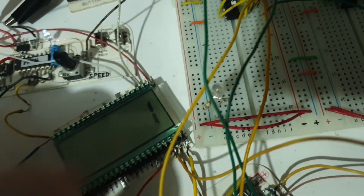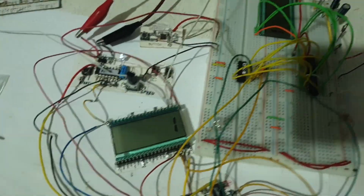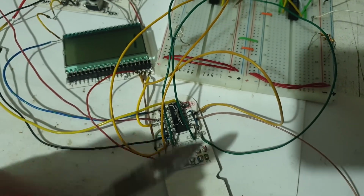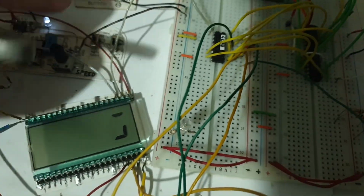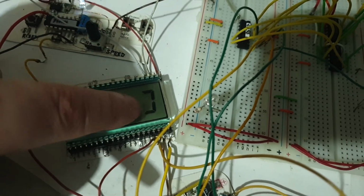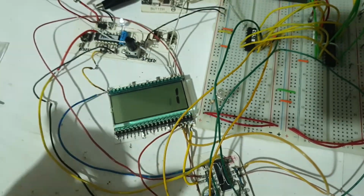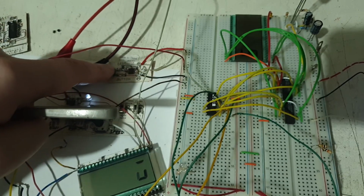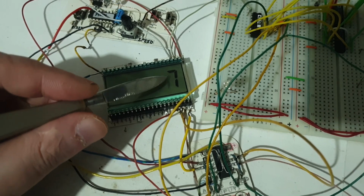You see that little guy there? Is this gate that I'm having here? So I mounted these two little gates here, and I made a new module here. And when I was testing, you see, when I'm pressing there, this little guy here, this segment here is ghosting. As you can see right now, it is ghosting seriously. And I mounted a button there to be more specific when I'm cycling. So see, I have this ghosting here. The same was happening on that segment and on that segment as well.